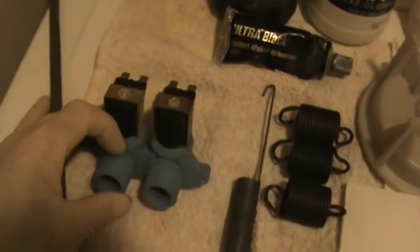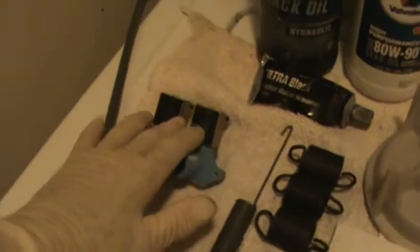One getting hot water — so what it was, the solenoid is bad. Screens are clear, so solenoid was bad. Replace this. I've got hot water.